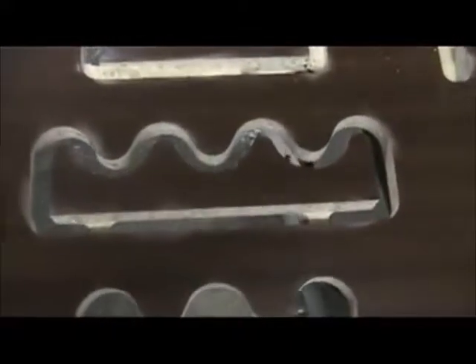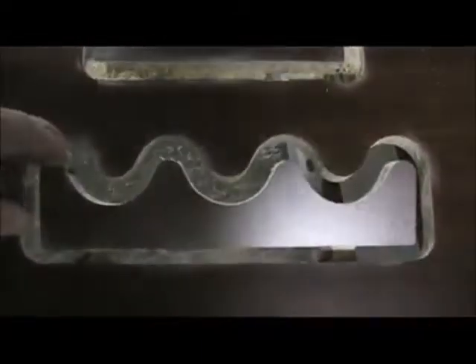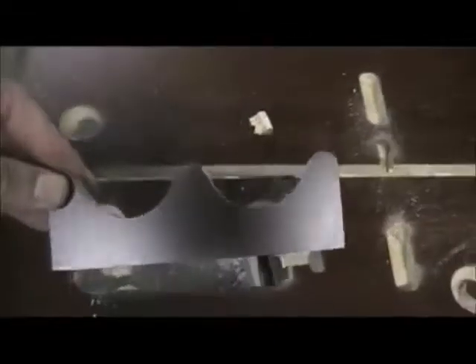As I was starting to look at this and pull it apart, I got really intrigued by these tabs. You see the tab on this part? It is so thin, and none of these parts moved. There's your piece — it's flawless. Just flawless. This little fellow right here — didn't move an inch. Right out of the board, like butter. This was a demo file sent to us by Amsec. As I pointed out during the cut, they were using tabs on the full sheet — we really only needed tabs for the small parts. The parts snapped out beautifully, which speaks to the flatness of our table and the care we take to square up the spindle. Thanks for watching this Freedom Machine Tool video.